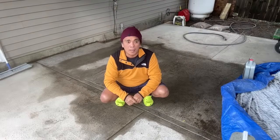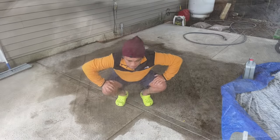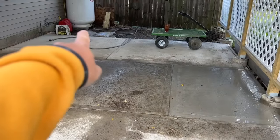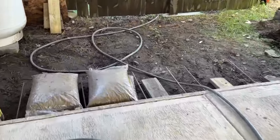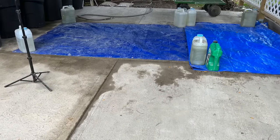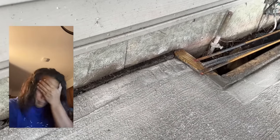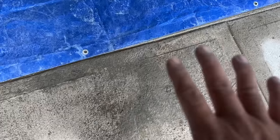I'm done for the season with two more slabs to go in the back. Let me walk around and show you what I've done. Here's what it looks like in its entirety — I did not do the part down there because the weather got really cold. I'm now into October. My last slab is right over there — I uncovered it but I'm using blankets and tarp to keep it warm while it cures. One slab curved out, and since it's day seven, next year I'll just drop some self-leveling compound on it — what's done is done.